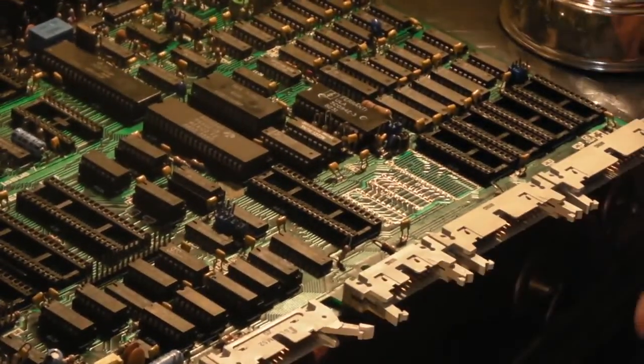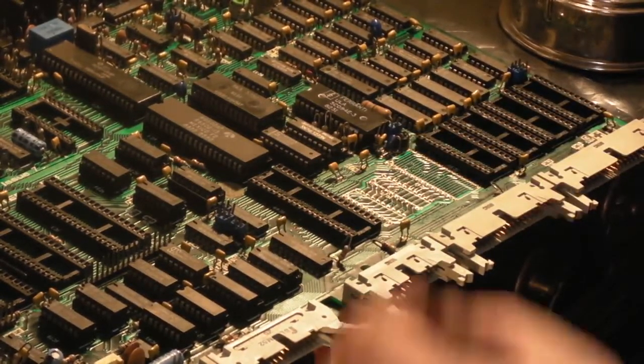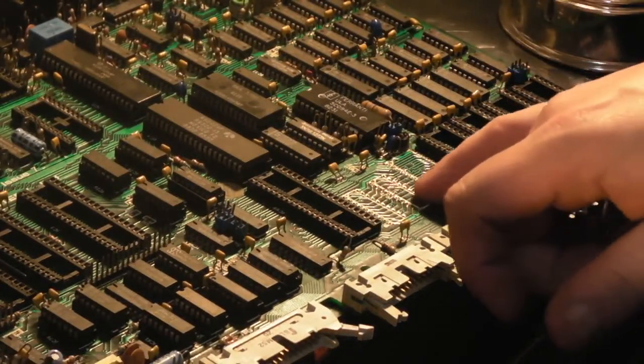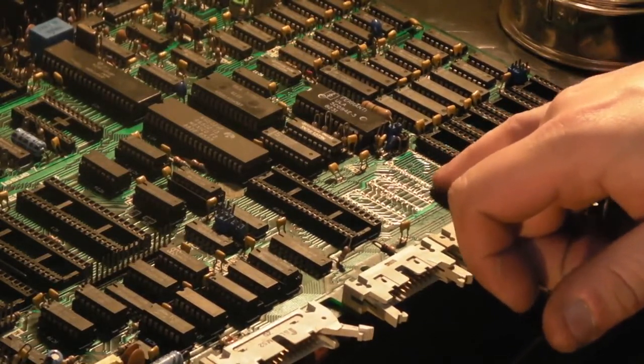No, it is that right one. So I'll hold it up to the light. That's the only one there that's blocked, and that's the one that we would push the wire into, so that's definitely the right one. Right, let's try the next one. So that's one down. We know one trace that we've got broken, which is from that via there.